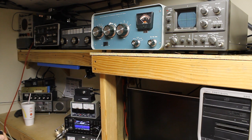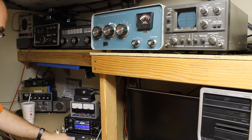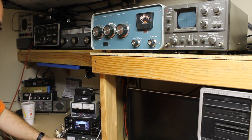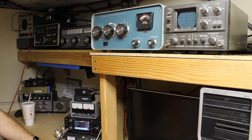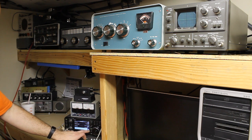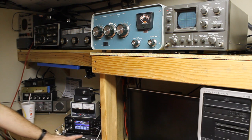We'll key up on CW. I've got the 7300 set for the mic up/down buttons as a morse key. The way you do that is once you're in CW mode, go to menu, then keyer, then edit set CW key set, and change your mic up/down keyer to on. That puts you in the correct mode.